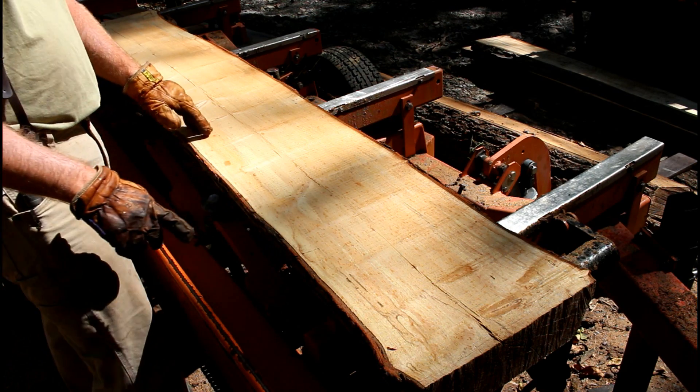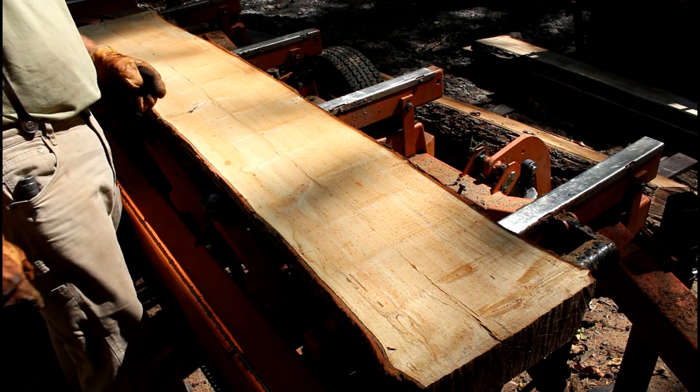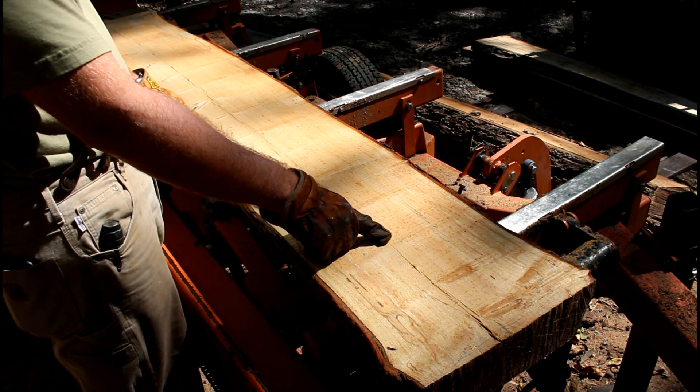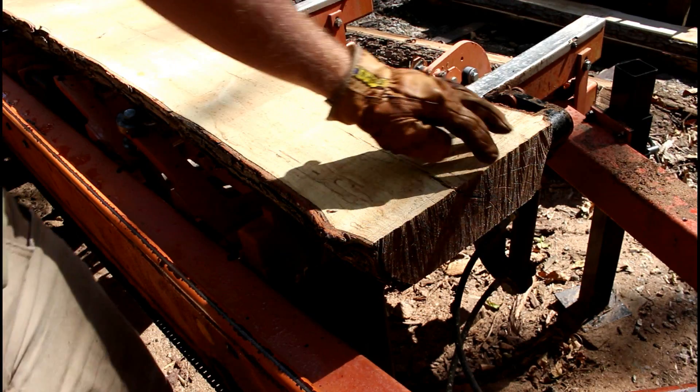What I want to do here is get rid of the pith, and that's this crack right here in the middle. We've talked about that a lot on this channel — getting rid of the pith. The pith is no good. It's junk. It's just going to be cracked wood. It's always going to move on you a little bit, and it's always going to have cracking. It's a good idea to get rid of it if you can.